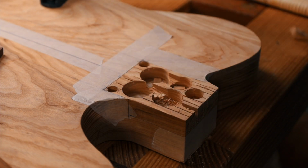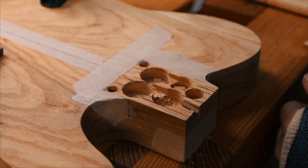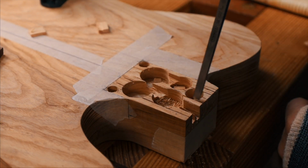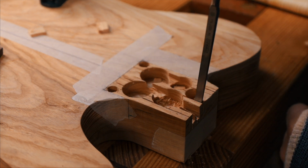Now I keep removing as much wood as I can. There's no real pattern here, just remove anything you can, doesn't matter how. Just make sure that you don't go past the bottom line and the contours of the neck pocket. Your worst enemy while doing this is wood splitting. I'll explain in the next video.